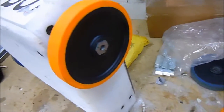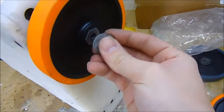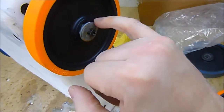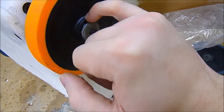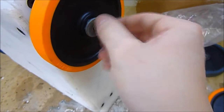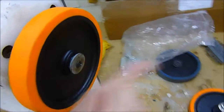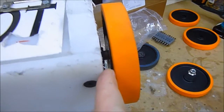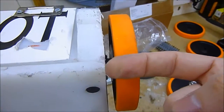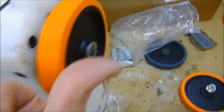And then all you need to do on this side is just take your M5 reverse thread screw as per normal and just tighten that up. Make sure that these washers here are also the same diameter or greater than the boss of the wheel on this side, so that once you tighten that up, that stops the wheel coming off in this direction. So you've got your M10 — or whatever size it is — 10mm washer in there, stopping the wheel going that way, and then you've got your washer for your M5 screw stopping the wheel going the other way.